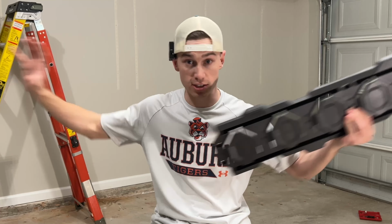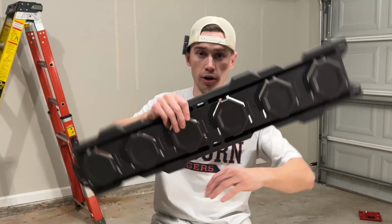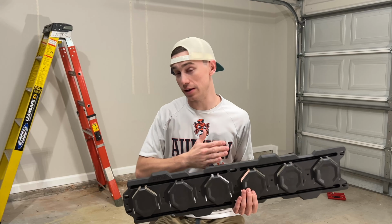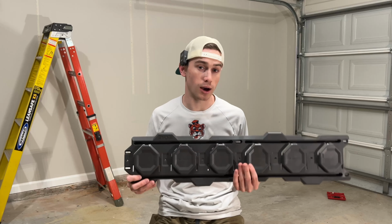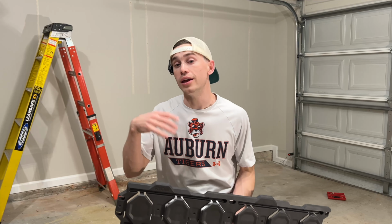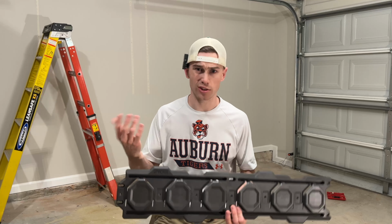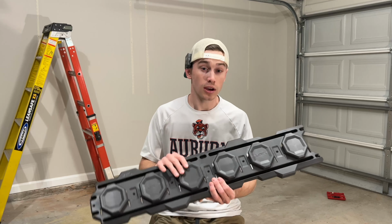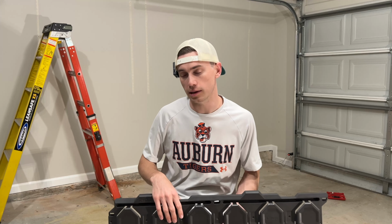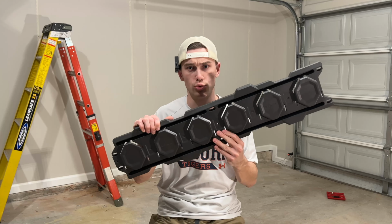So I'll have a 64-inch rail, but you can also mount them vertically like this. So I was just really impressed that Ryobi gave that forethought to giving you the option to mount these with hitting 3 studs every one rail. If you are in a situation where, let's say you're on like 20-inch centers for some reason, they also give you the drywall mounts. It's just not as strong. So yeah, 32 inches, it's really, really nice.